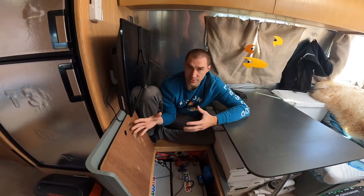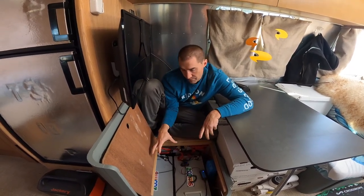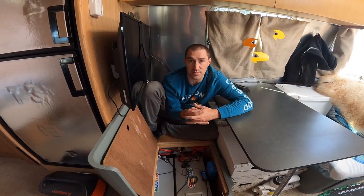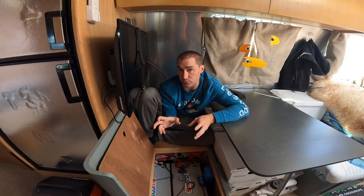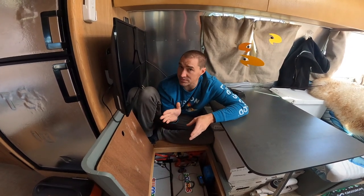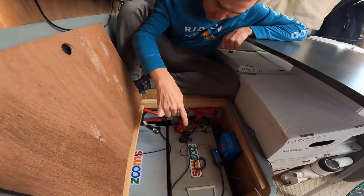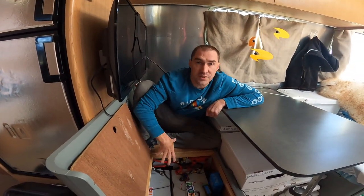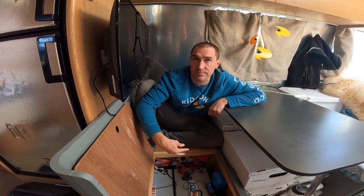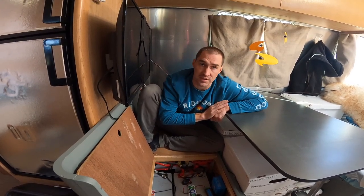We've taken about a year to buy the components as we could afford them and put this together. I haven't done a video explaining my installation partly out of reluctance to demonstrate how this is done and potentially make errors. I did figure out I had a pretty significant error — I had run the battery protection unit wiring a little bit wrong. It lasted nearly a year, but it cooked itself pretty bad. The install was also kind of ugly and messy because it kept being: add a piece, do a thing, add a piece, do a thing — I could design it better with shorter wire runs and neater layout.